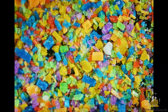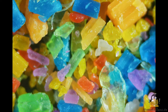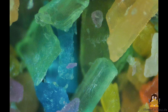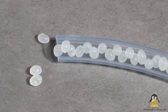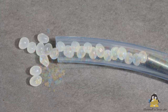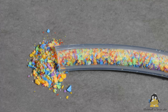A look at the sieved end product under the microscope shows that there are many grains with a diameter much smaller than 2mm. This is not a disadvantage but rather a great advantage, because the extruder needs the raw material to be packed as densely as possible to function well. The finer the extruder has to feed the plastic to print fine structures, the smaller the hole for the extruder screw conveyor and thus also the particles of the raw material have to be. If we could somehow feed industrial pellets like a string of pearls through the 8mm bore of my extruder, the plastic would come out in waves. If the raw material consists of a mix of different grain sizes, we get a more uniform extrusion rate.